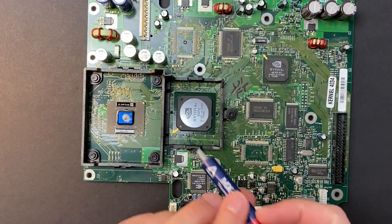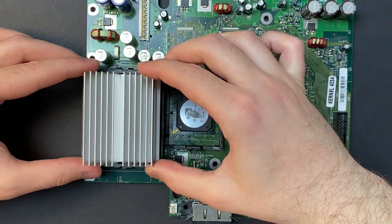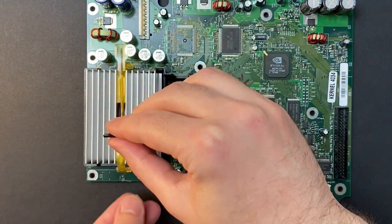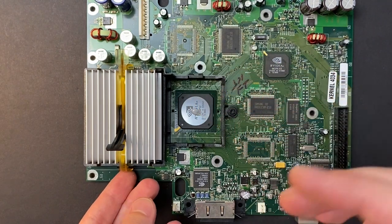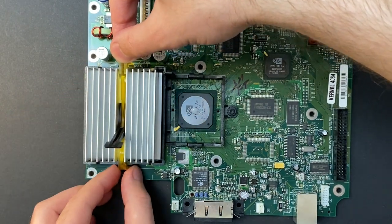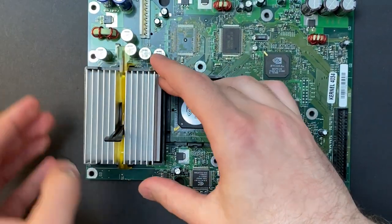That's probably way too much, but it doesn't matter. When it comes to thermal paste, everyone's got their way of doing it. The key thing to remember is when you're using conductive thermal paste, that's when you have to be concerned. But all this non-conductive stuff doesn't really matter — if a little bit oozes out, it's not going to cause any issues with the board or short anything.